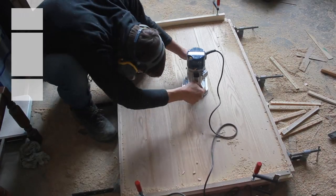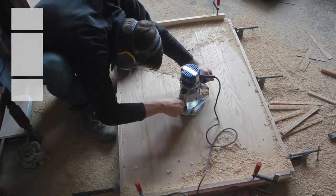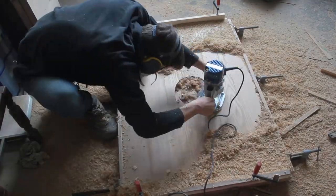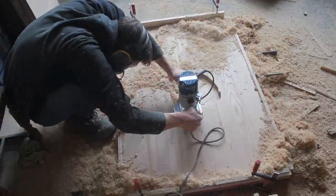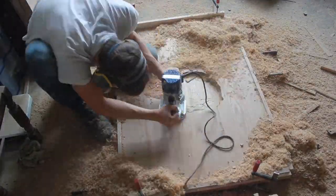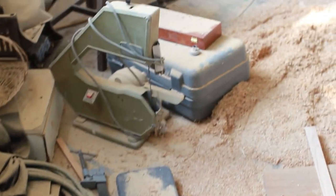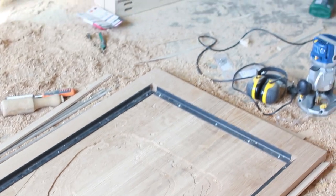In the design, the leaves will be stored underneath the tabletop. Since they are both 40mm thick and will be stacked one on top of the other, I wanted to recess them up into the underside of the tabletop to reduce the depth of the apron rail. I used fences around the side of the tabletop to maintain an area of full thickness around the edge, then made multiple passes in a circular motion with the router to remove the material. It generated a lot of sawdust — initially the top weighed 30 kilos but by the end it only weighed 15.